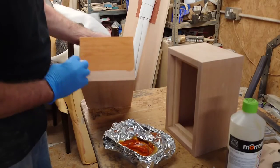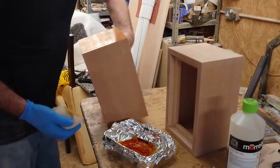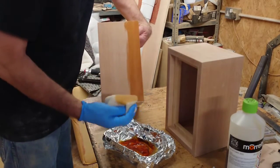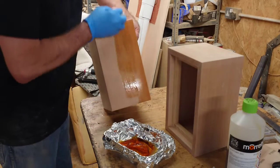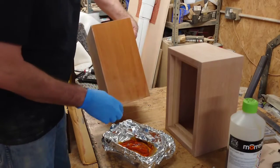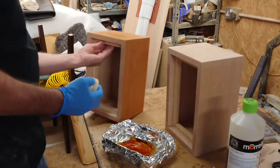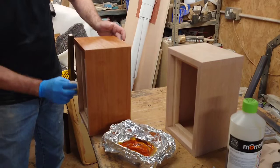A rubber, which you use for French polishing, is usually a bit of hospital sheet. They're old hospital sheets cut up into a square, and then I wrap it around this, which is a piece of stockinette rag. You can also use some skin wadding, which is used for upholstery, so a lot of people use that, but I tend to just use this. So obviously we've got to do the underneath as well.